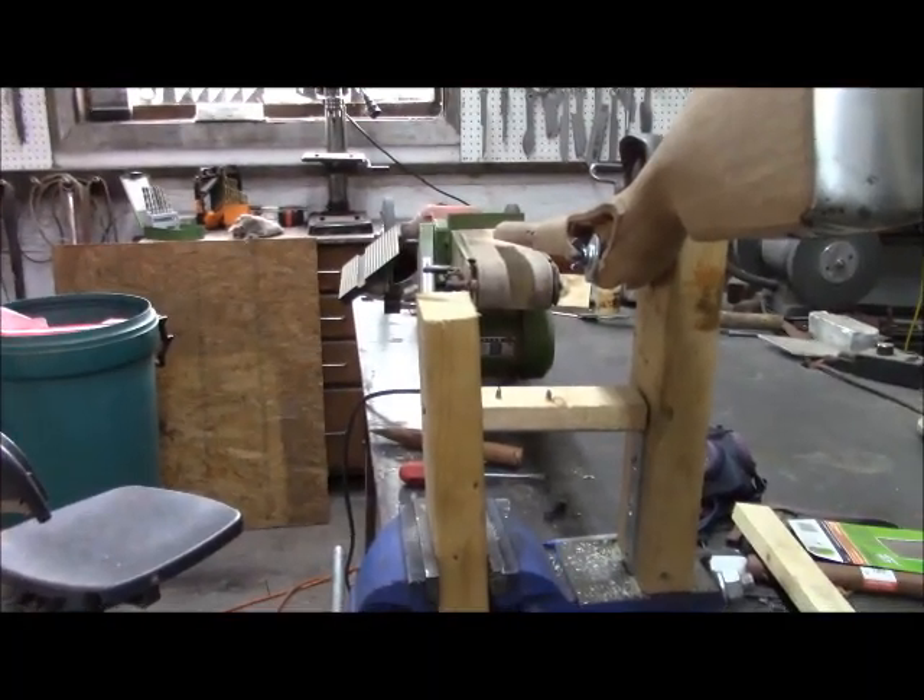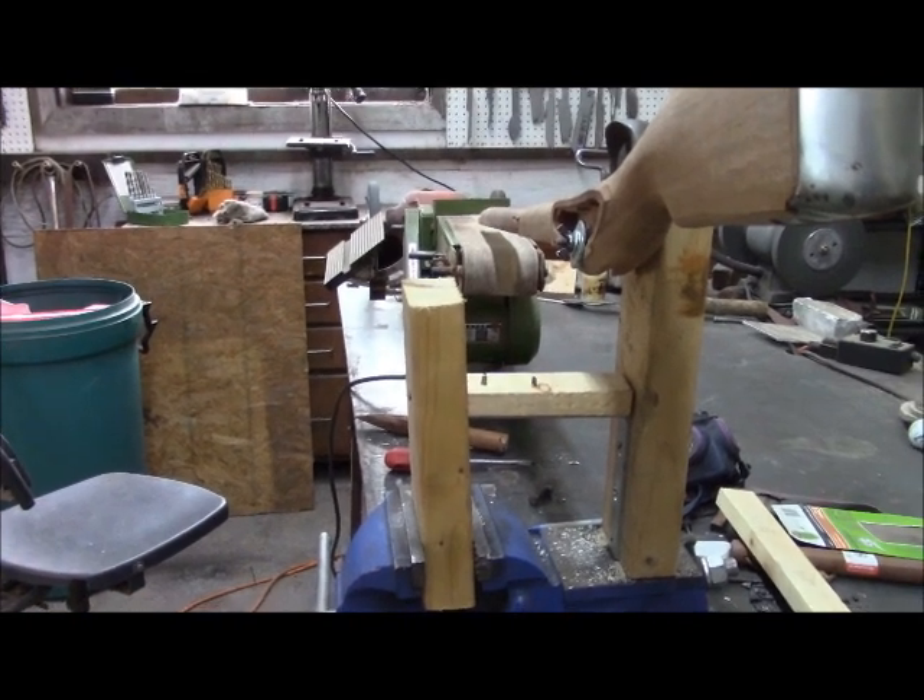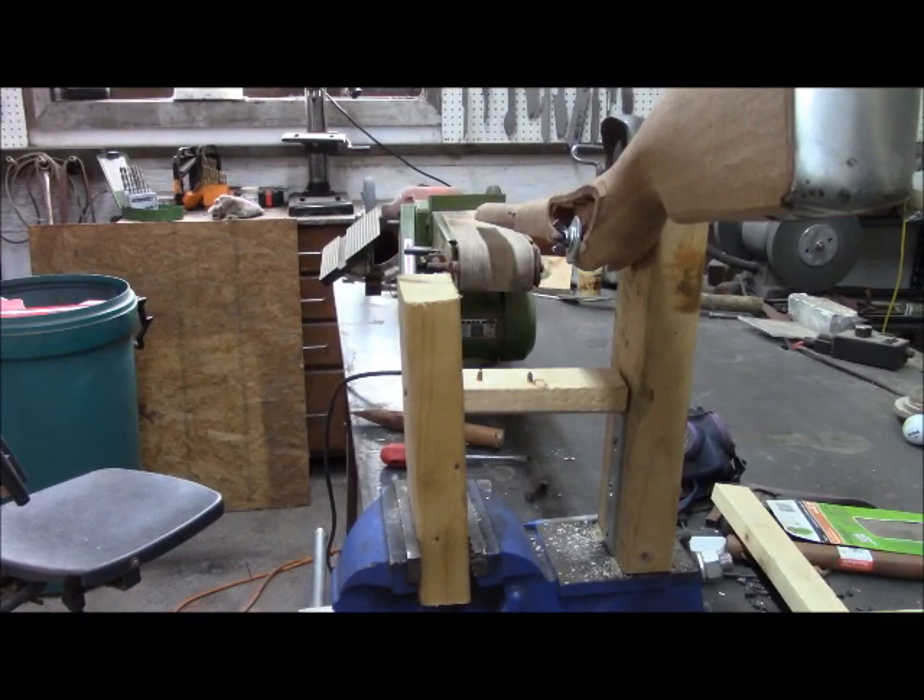We now have the gun and our homemade jig ready to go on the flatbed sander. As you can see, I have wing nuts and some rather large washers on there to keep from unnecessarily marring the wood. Plus, this is soft spruce, so it will not make much of an impression on this walnut, which we are going to sand away anyway. It looks rough and it is rough, but it works — and that is the important thing.